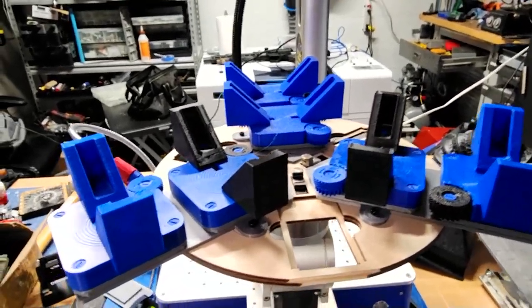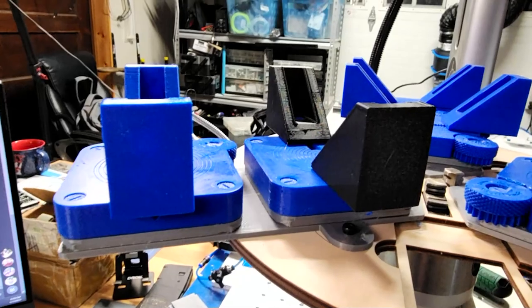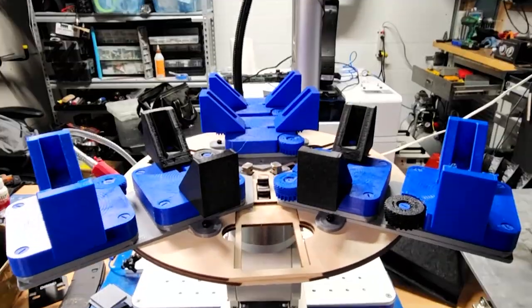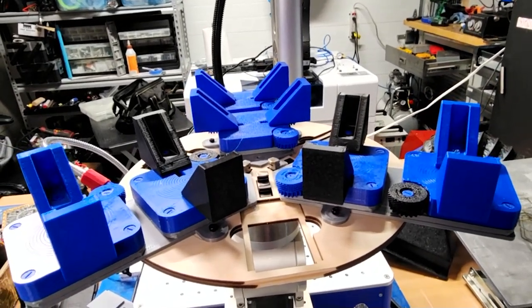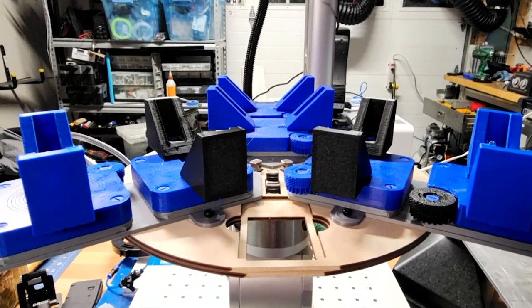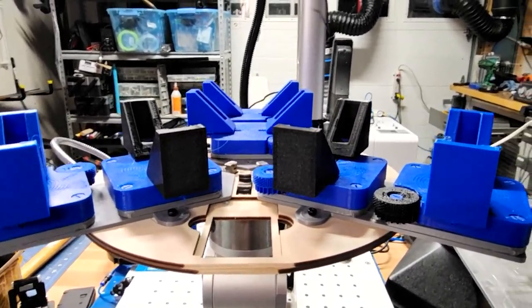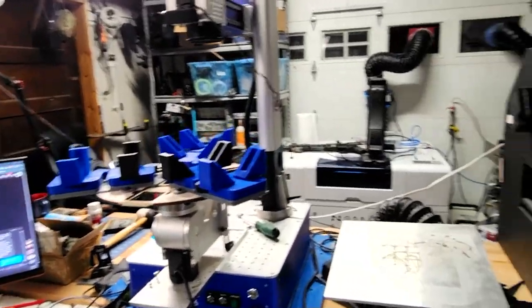You can see how it's fastened. What we have here are 3D printed jigs — basically cup jigs — which are actually two two-jaw vices on a modified base plate that I modified to specifically fit on these rotary jigs. That vise was created by Sneaks over at Printables. I'm going to put a link in the description to this vise. I remixed it to 75% with one base to hold two separate vices. You can use this base to hold the other versions of the vise scaled down to 75%, or you could increase my base by 25% and use it on a full size. I'll link that in the description.